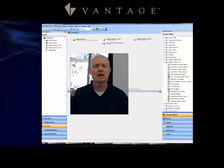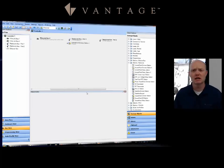With additional antennas, notice that a station talks to the specific antenna it is assigned to. In this scenario, this scene point dimmer talks to the port one antenna. If I've got them spread apart by 60 feet with attenuation or RF interference from a 900 MHz phone, I can simply change which antenna that station is looking at and see if that helps fix my problem before incurring the cost of adding additional controllers and antennas.